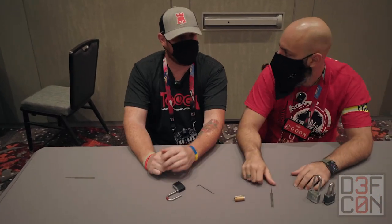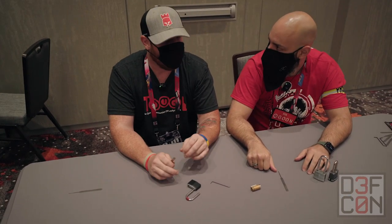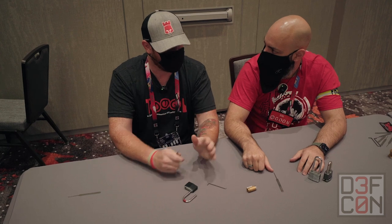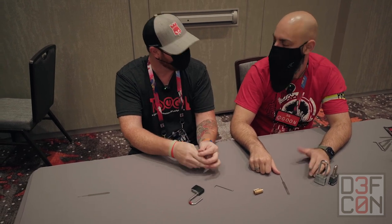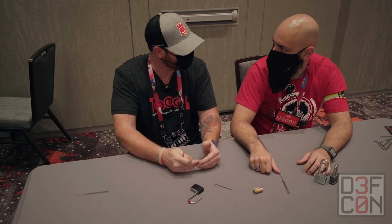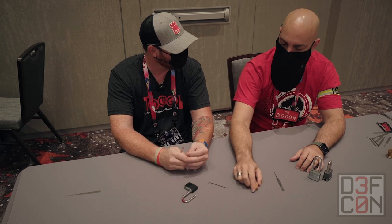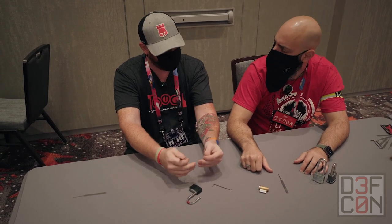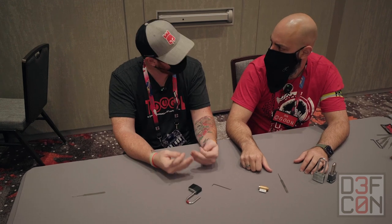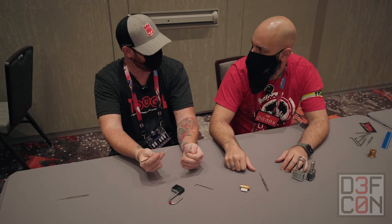Yeah, so a progressive set, when you're first getting the feel of it, is going to be the best way to go. The reason is you can spend a lot of time on the 1 and the 2. With the 1, just 1 pin in there, you can make that pin bind or not bind. So if you don't have any tension on the lock, the pin's not binding. You can feel what it feels like to have a springy pin. Okay. Then when you put any amount of tension on there, you can feel what it feels like for that pin to resist your pick.